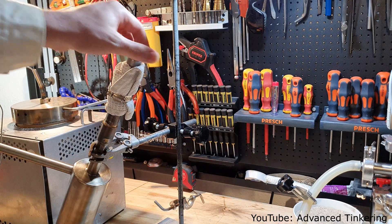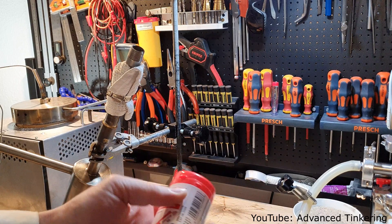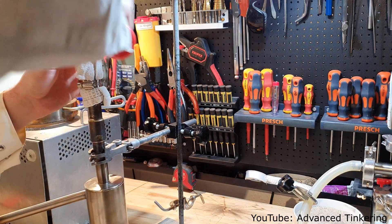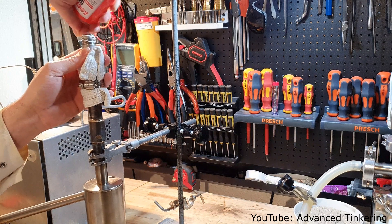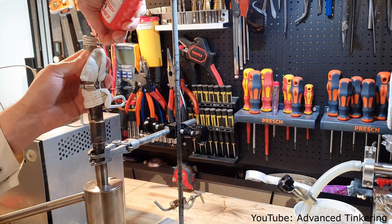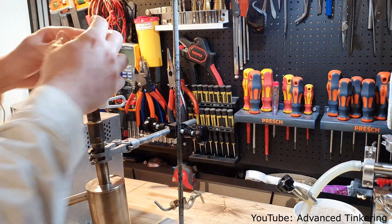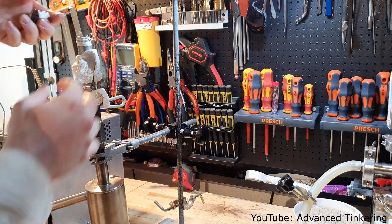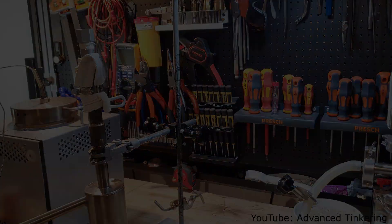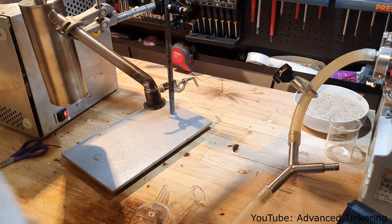The next step is to seal the threads. I'm using a thread-sealing thread without any PTFE — it is a polyamide, nylon-based thread sealant. Since I lost the original footage I'll use the time to explain: it is crucial that cesium does not come into contact with PTFE, also known as Teflon, because cesium is able to defluorinate Teflon. I don't know how vigorous the reaction really is, but I don't want to find out. The reaction between fluorine and cesium is very violent because cesium wants to give up its outer electron and fluorine wants nothing more than an additional electron. That's why you shouldn't use PTFE thread sealant, a PTFE stir bar, or a PTFE tube to transfer cesium. Next I connected the receiving flask using a KF or QF flange fitting, greasing the o-ring slightly.